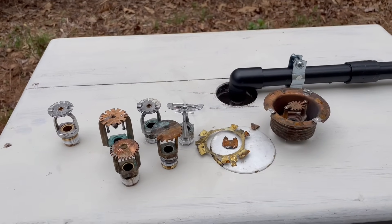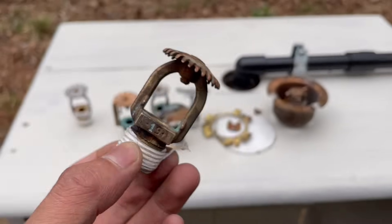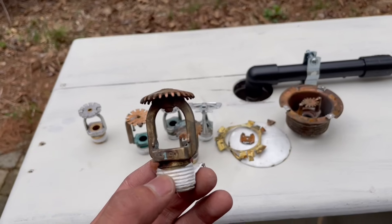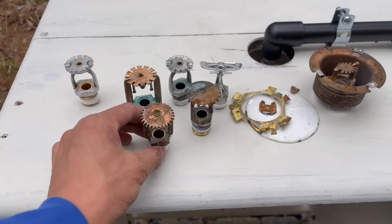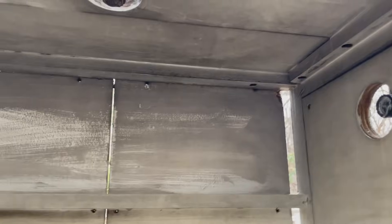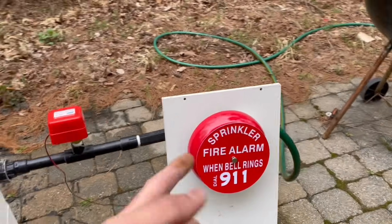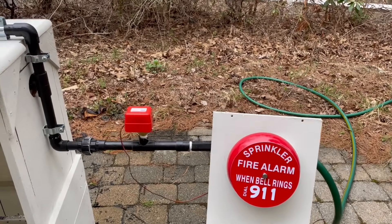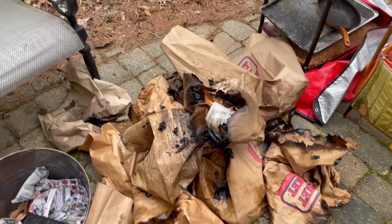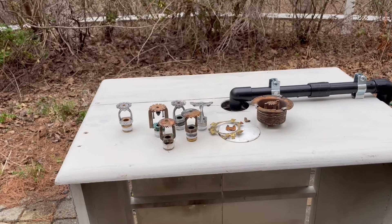Well, there we have it. Here are all of our activated sprinkler heads. Pretty much every single sprinkler head except for one activated just fine. That one technically opened but there was too much buildup inside the orifice, which is why it didn't fully activate. I found that one in a dumpster on a pipe, so the debris may have been external — but either way, if there's any trace of an issue, you've got to replace it. Thank you for watching, like, comment, and subscribe. I hope you learned something today, and see you next April.